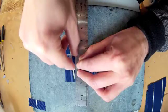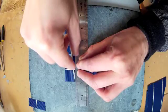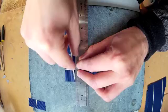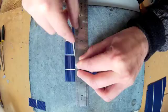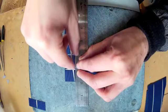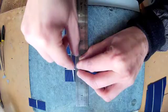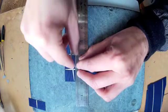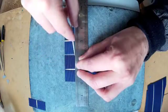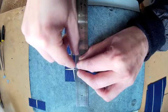I did try to cut these with a diamond wheel on a mini drill — I made a small bench up for it. But I found that the edge it leaves sometimes will short the solar cell out, and then you need to actually sand the edges of the solar cell to get them so they're not shorted. So I just think this way is a lot easier, and there's a lot less dust as well.